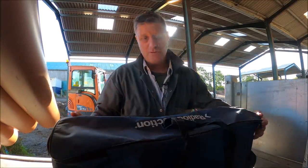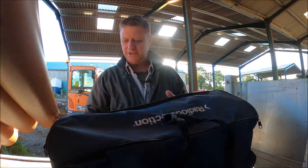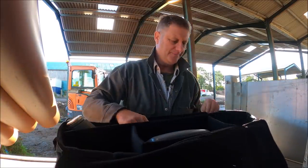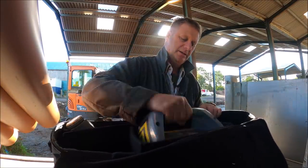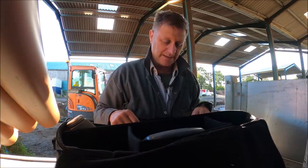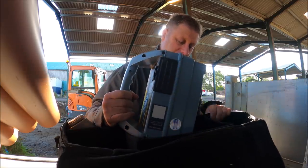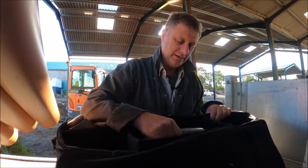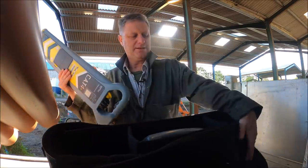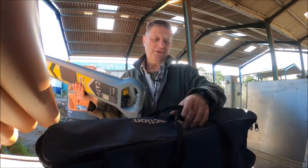Okay, some of you will know what this is. Some of you may well have seen one and wondered what it is. So I'll tell you. This is a Cat and Genny set. So basically, that's the Genny. We're not using that today because we know we've got a live cable, we don't need it. And as far as depth is concerned, although I could get a depth reading off of the Genny, I kind of don't need to. All I need is this fella here, which is the Cat. So this is a Cat 4.